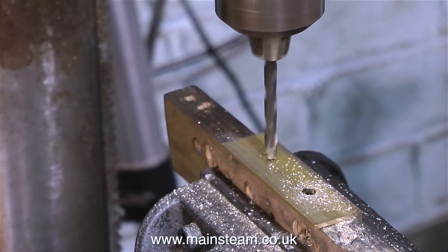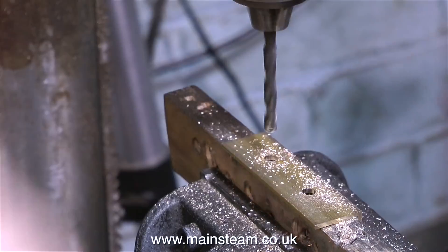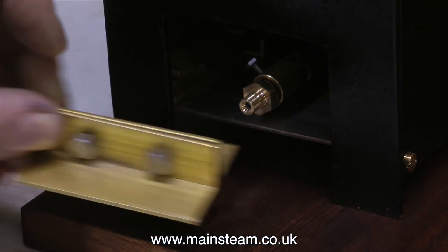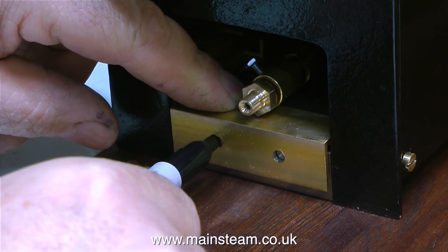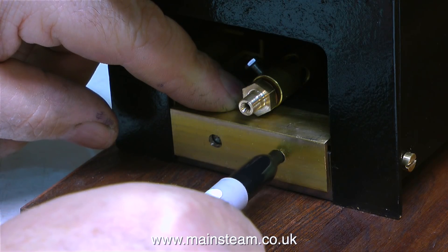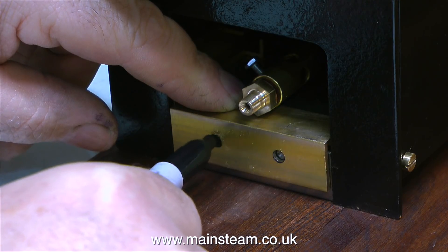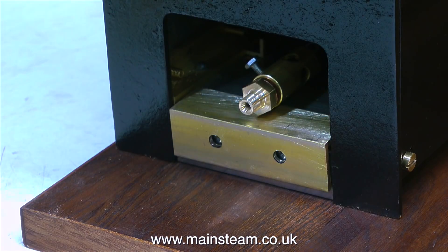Then all that remains is to enlarge the holes with a twist drill — a 3/16th of an inch diameter twist drill. When the parts are drilled, I could bolt them together using a couple of 2BA bolts, but instead I'm going to use a felt tip pen to transfer the positions of the holes in the brass angle onto the steel blocks. This has to be done in position, because I need to allow for the thickness of the piece of stainless steel — the bed plate that holds the burner — to sit between the steel block and the brass angle.